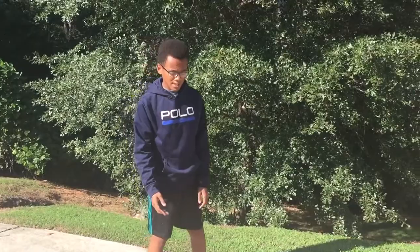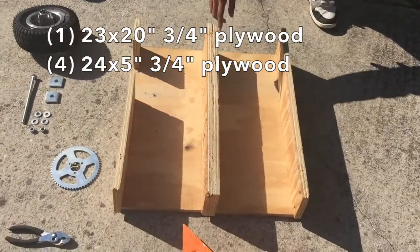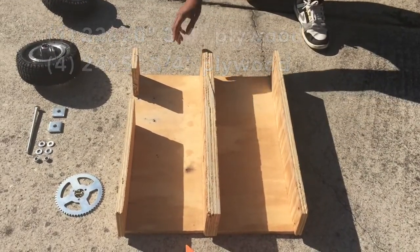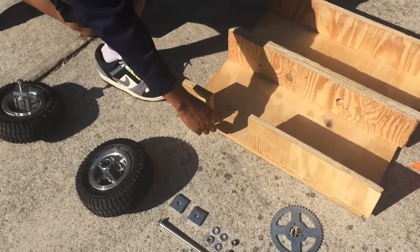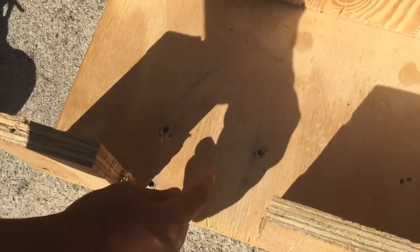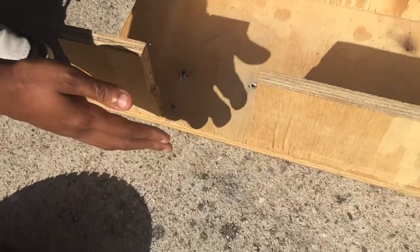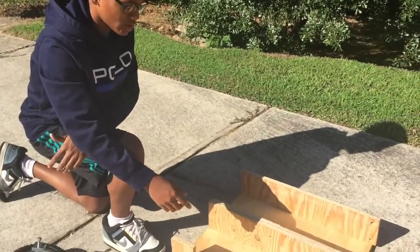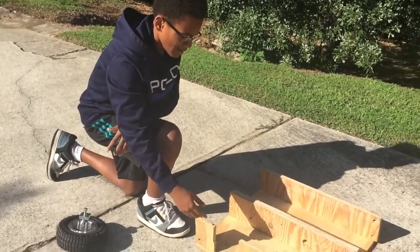For the frame, what you will need is one 23x20 piece of plywood on the bottom, two 24-inch long 5-inch pieces of plywood in the middle and on each side. It's cut on this side to make room for the motor. As you can see there are holes right here — they are one-fourth inch holes and you can just drill them with spade bits. How you know where to drill them is you're just going to want to line up the motor with the chain and the drive sprocket, and if the chain is straight, then you just draw in with marker the holes in the mounting holes, then you drill.